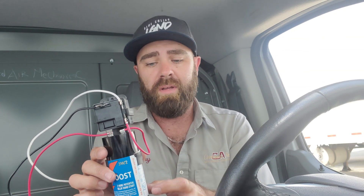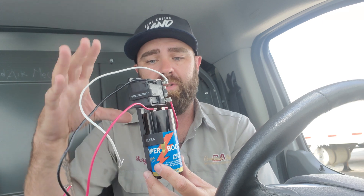The kit includes a start capacitor on the bottom and a potential relay on the top, and it comes with a sweet little bracket to keep everything together. You'd take them off, mount the bracket, then mount everything back on — it keeps it all nice and neat.